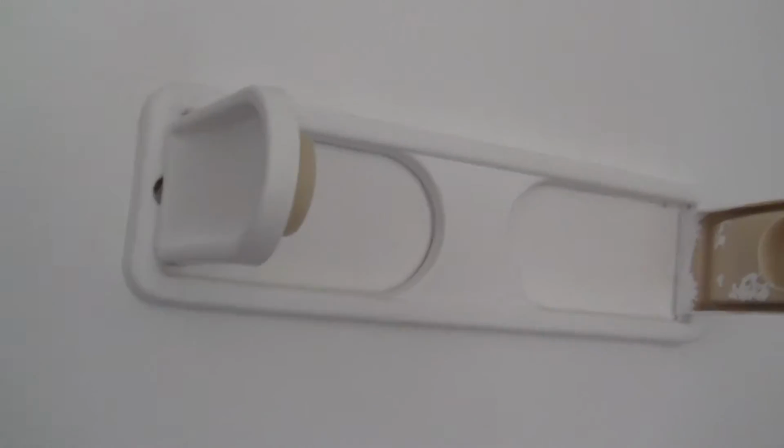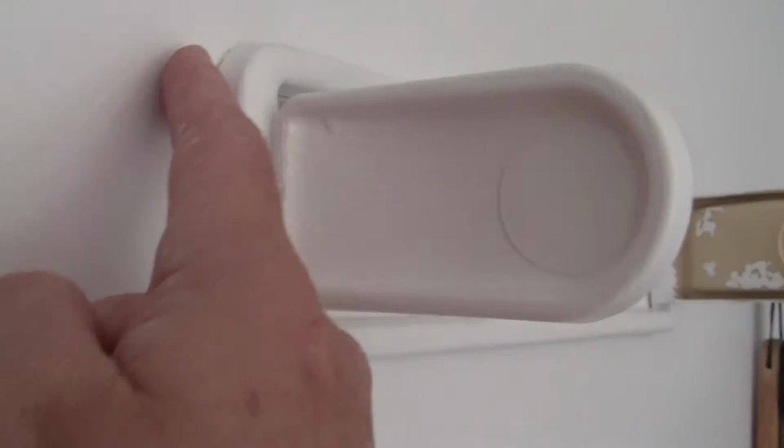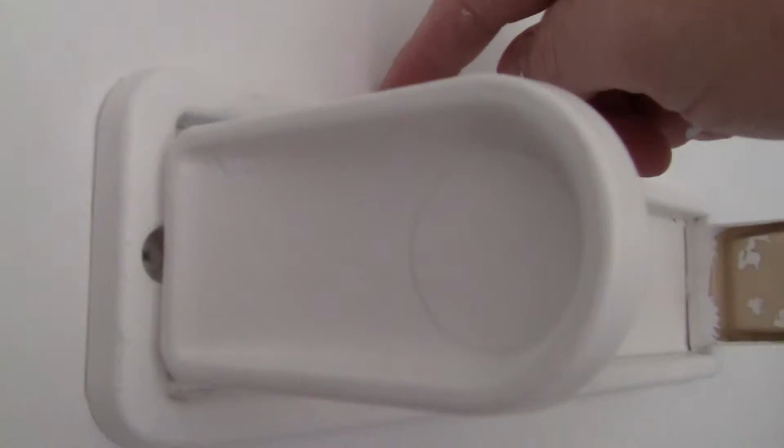And remember, after you caulk something and you want to get it taken off, all you got to do is take your little knife and cut right down through here or wherever you have caulk at, and it'll come off. With this cabinet here, where I've caulked this in, up here, all you do is you take your cutting knife and just go in a quarter inch, cut that down, and take your cabinet out. And then after you put in new cabinets, you can do it again, or put in just new caulk.